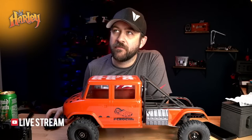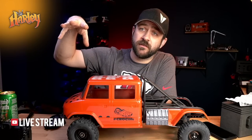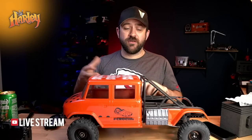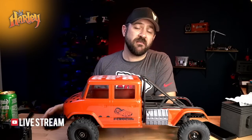Off the top of your head, how many components do you need to undo on a Phoenix to change the ratio? If you just take off the 6 screws, you can basically just pull the transmission up. I guess if you have dig linkage, you'd take off those two, dig and overdrive, 8 screws at the max. You don't really probably need to remove the whole motor and everything. You just kind of move it over, do it with it there. That's how I would do it.